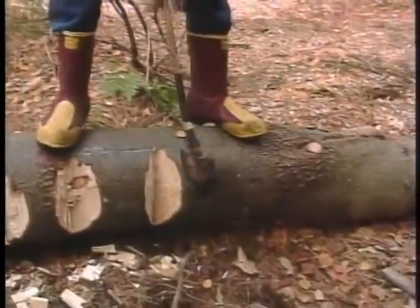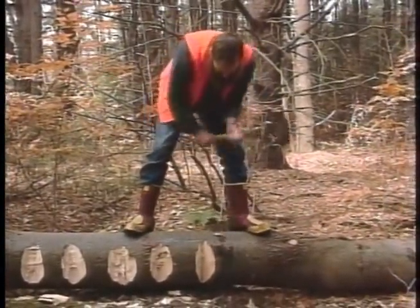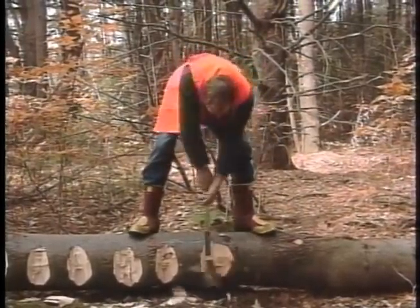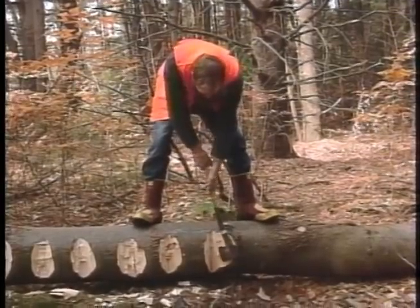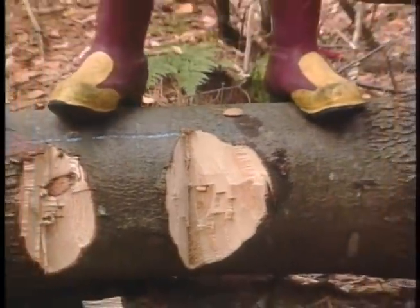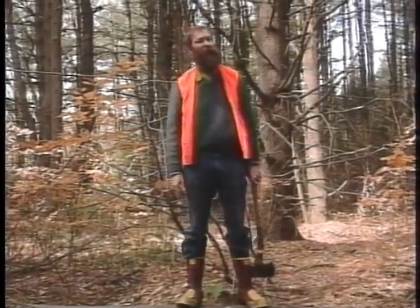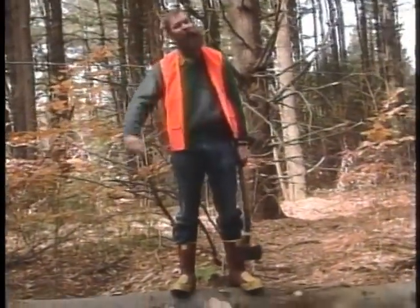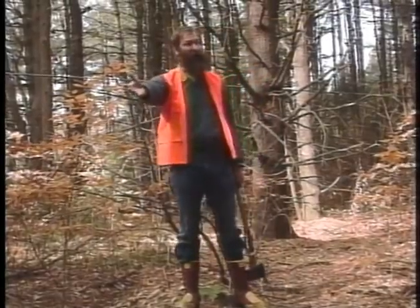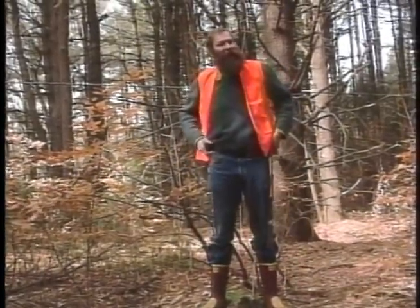The other line is theoretical and it's directly below the blue line in a vertical plane. This string defines the vertical plane. So I've got my straight line and my vertical — that's all I need to make one side perfectly flat, which is impossible, but we get as close as we can. Now watch out for the death quadrant. The trick to hewing is the approach of the chip. I'm just making a place now — making myself a spot from which I can approach that first chip. I'm starting toward the top of the timber because I'm left-handed. It's easier to go from the top down. When I do the other side, I've got to go from the bottom up.